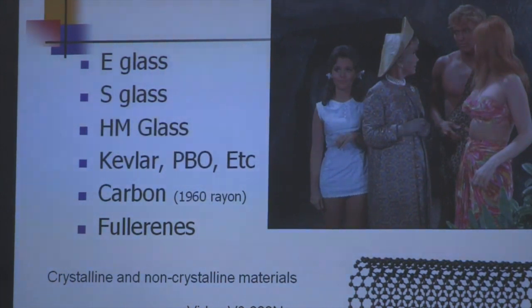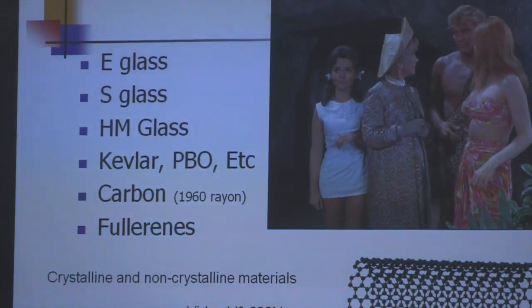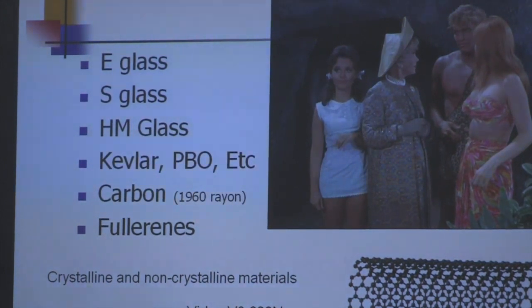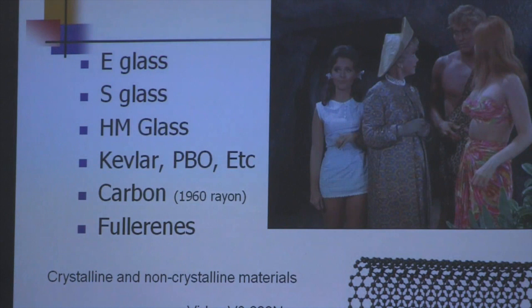Okay. Peter, that old reel of carbon fibre, is that the same as the material you buy today? You can't buy T300 now. You'd probably buy what's called T700, which is a bit better. The Chinese are making T300, but it used to be called high strength. I forget what they call it now, but they don't use that term anymore, because they used to make carbon from coal pitch, which wasn't as strong, and then something made from what's called PAN fibre or rayon is much higher strength, and they called it high strength, but they don't have that distinction now.